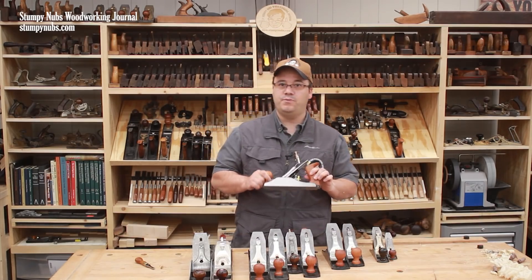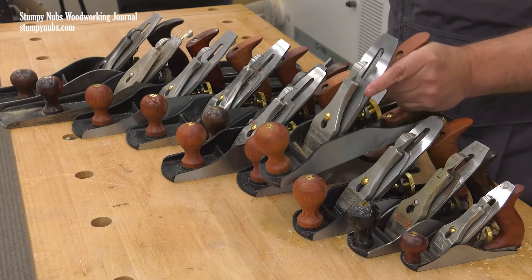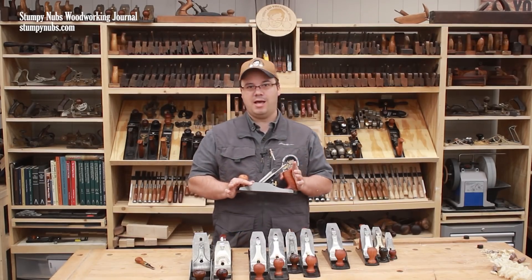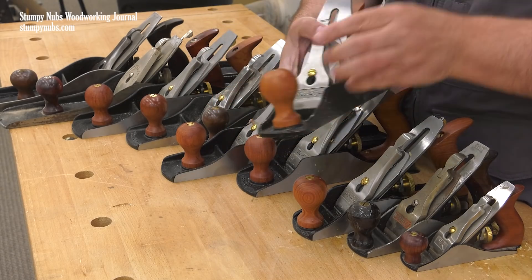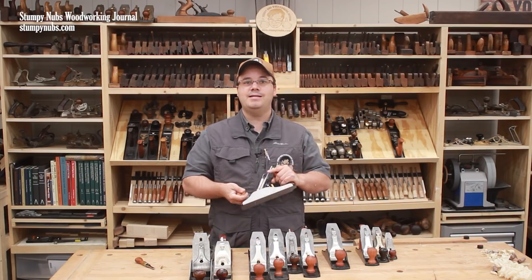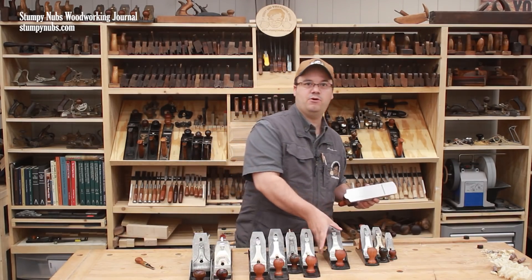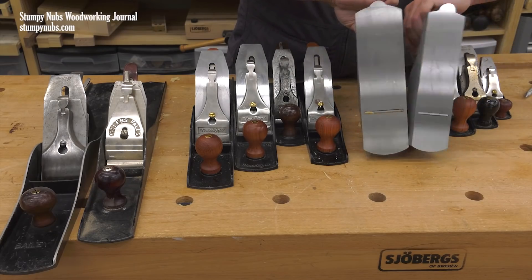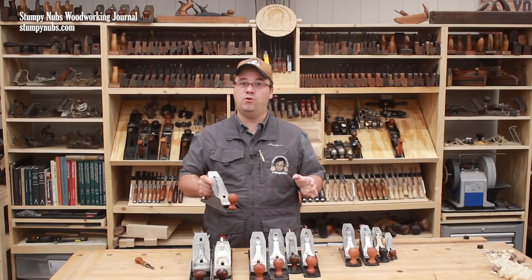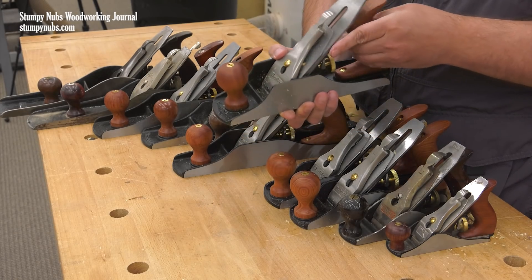The difference is, unlike the number two, the number three can be gripped by a normal adult hand. And though large-handed woodworkers do find it a bit confining, that's where the next size comes in. The number four is the second most common bench plane in the whole lineup. While it may be used for all sorts of odd jobs, its primary purpose is for smoothing wood. Many consider the number four to be the perfect size for that purpose because of its relatively lightweight that won't tire you out quickly, and its relatively narrow iron that isn't difficult to push through a cut. Others prefer to get the job done faster, so they favor a slightly larger 4.5. Not only will its wider iron finish the job with fewer passes, but the extra mass of the 4.5 adds momentum that some find useful for powering that iron through the cut. The 4.5 is considerably less common than the number four, but it's my favorite of the smoothers.